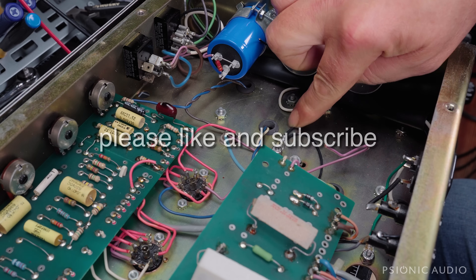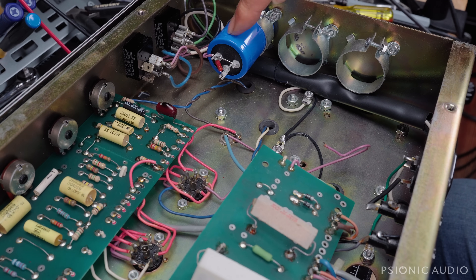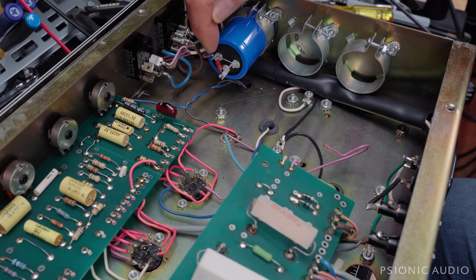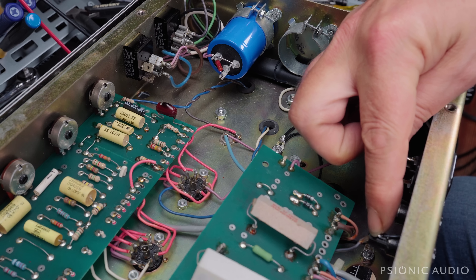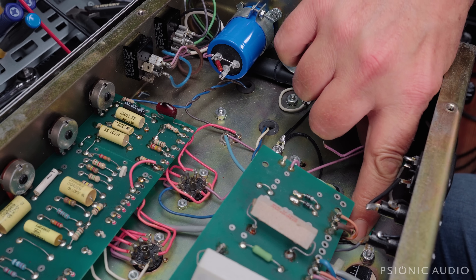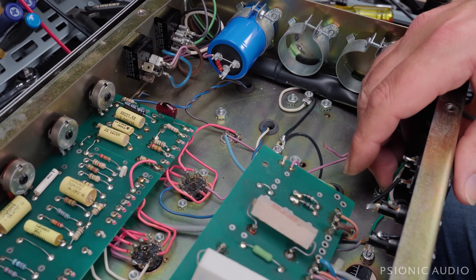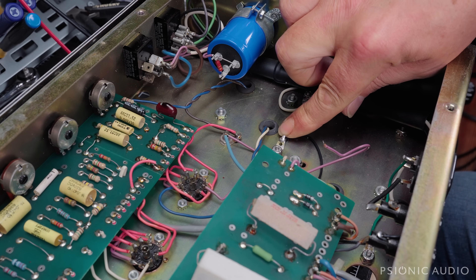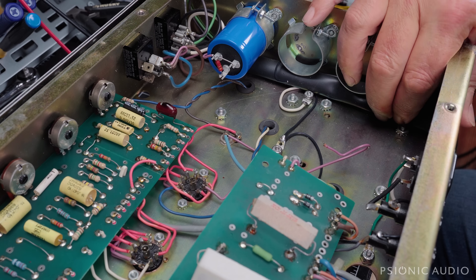This one here with the two black wires — this one goes over here. It's about to be the negative for the reservoir cap, which is a series connection from here to here. The positive is going here, and these two are bridged to make a 200 microfarad cap with a 220K resistor across it. The next capacitor will be done the same. The other black wire goes over here to the fuse holder for the HT fuse. There's an additional existing hole down here where I put another ground lug, and that is for the green wire going to the IEC connector. So the IEC safety ground has its own dedicated hardware shared by nothing else. The HT center tap and reservoir cap ground is by itself, and then this is just here for the shield wire of the transformer.